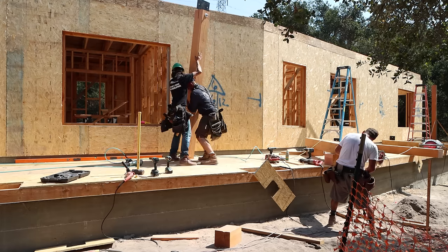You can see that we've got everything braced off of here. One going up that way, one going up this way, that's gonna lock everything together. Not allowing it to open or close. Once we get our rafters up there, we'll test fit, throw them in, see what needs to happen. If we need to adjust at all, we can.